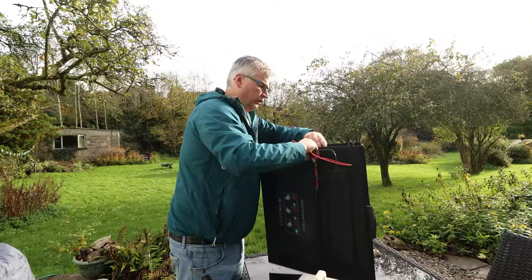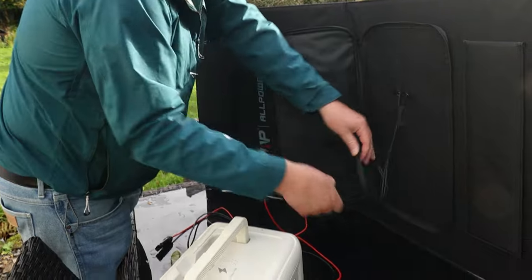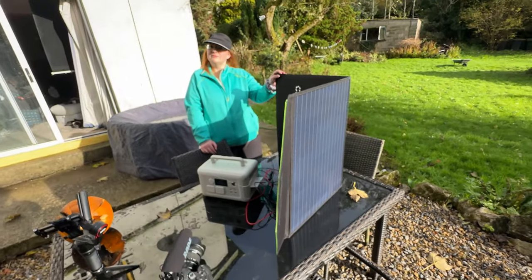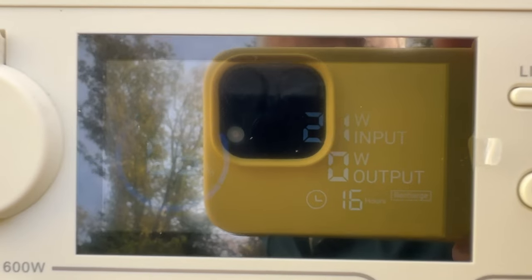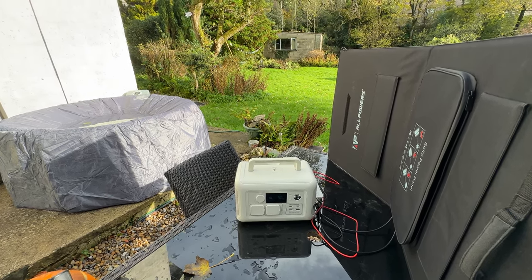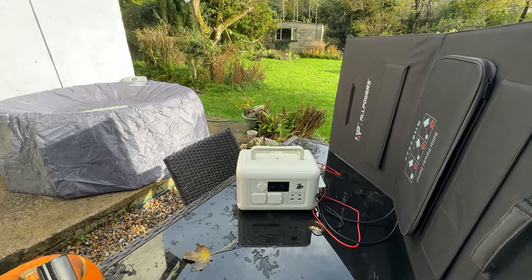As we established, you do need direct sunlight in order for this to work. If you unzip this pocket, you will find the cables you need already connected. First: unzip, open and position. Connect the solar panels to the power cable, then plug the power cable into the R600. And don't worry, you can't plug it in the wrong way. Now you're connected and ready to go. It's that easy. One thing to note when using this: make sure it's not too windy, and secure them against something so they don't blow over. Success — the input's increasing. 21 watts. With both panels facing the sun, looks like we're getting about 20 watts off each panel — 43 watts input. The only thing to remember is that it will take a fair bit longer to charge the unit using solar panels. The more solar panels you have, the bigger the charge your R600 gets. That's not bad if you're on a campsite or parked up, with these just pointing at the sun — free energy.